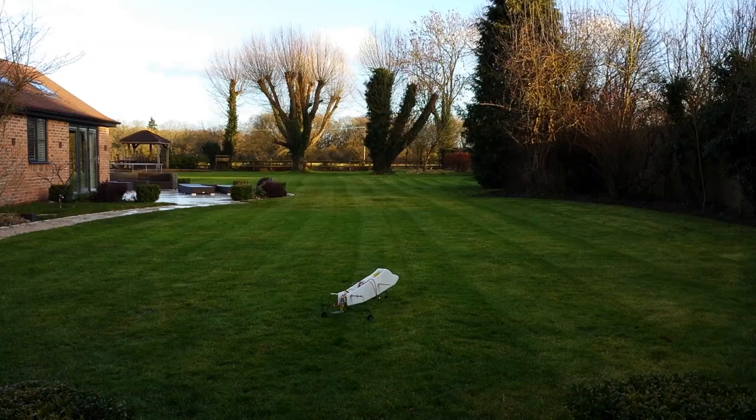So what I think was going on here was that the heavy fuselage then increased the inertia of the roll axis, and the rolling moment caused by the motors and the gyroscopic inertia resistance just wasn't enough to counteract the extra weight of the fuselage. So my next idea was to build a profile fuselage, which would be slightly lighter and slightly easier to build, and this is how that went.